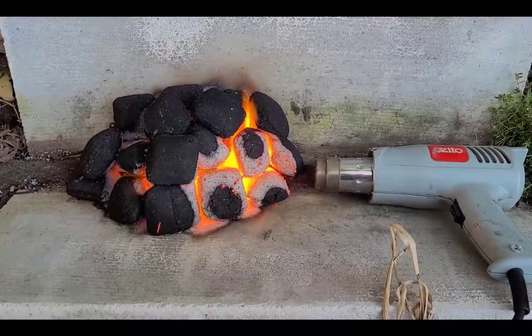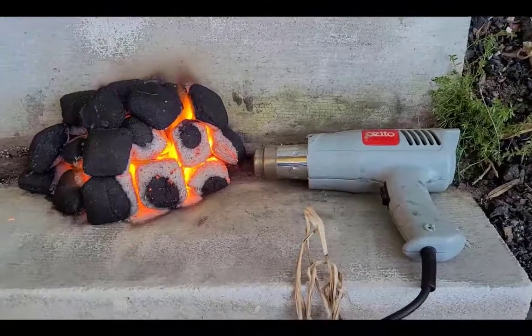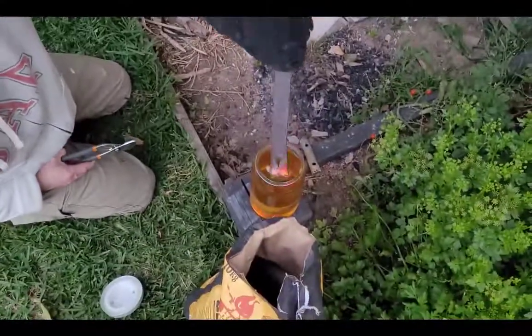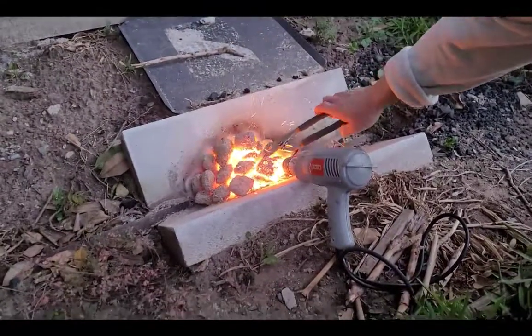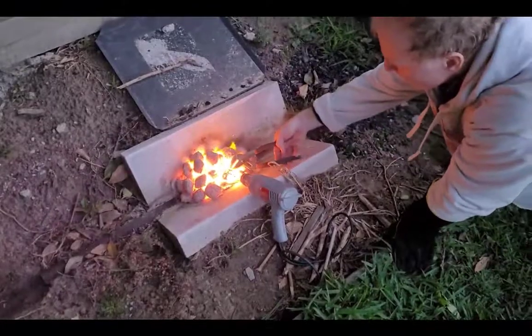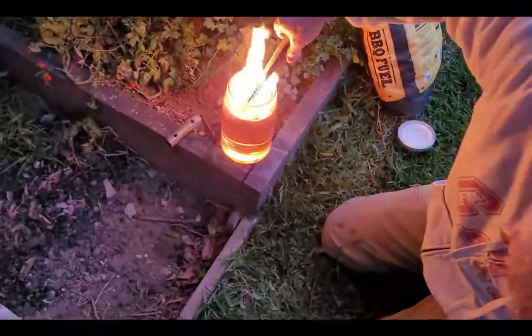The clay was fast drying so it just needed a few days to dry, then I put it into my simple backyard forge surrounded by some charcoal barbecue bricks. Then, with the addition of some forced air, I left it to cook at high heat for around two hours to hopefully absorb those carbon atoms. Before quenching, I warmed up the oil a little using a hot piece of steel to ensure it was viscous enough to cool our samples properly — something else I learned from YouTube. While my carbon wrapped sample was cooking, I heated up my control piece in the forge and then quenched it in the oil, much like you would heat treat high carbon steel. This was to ensure that the only difference between the two was the carbon treatment process.